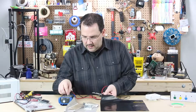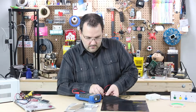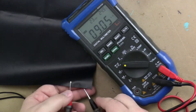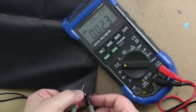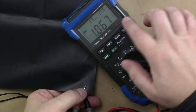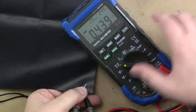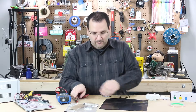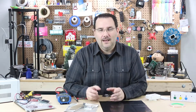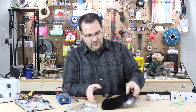The next thing I want to look at is called Velostat. I can measure its resistance with pressure. I've got my two leads on top and bottom, and when I put them together there is some continuity — measuring about 1K in resistance. If I squeeze it, the resistance goes down. So this could be used as a pressure-sensitive plastic or film between two leads, or as some kind of sensor. It won't be as accurate as a dedicated pressure sensor, but it's a very interesting type of material you could use in your project.